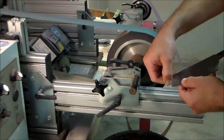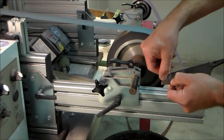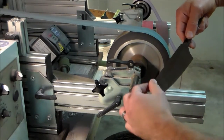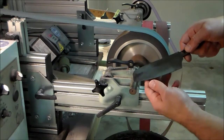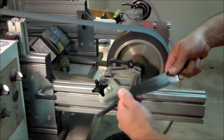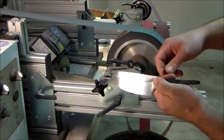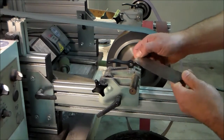The tip itself has some scratch lines still, but I'm going to cut this away anyway so that it has a round point. I always leave this bit until the end after heat treatment, because should the blade have warped during heat treatment, it's much easier to fix it if the blade is more or less the same. But if it ends in a sharp point, it is more difficult to fix.